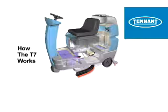When using the conventional scrubbing systems, water and detergent from the solution tank flow to the floor through a solution valve. The brushes, along with the detergent and water solution, emulsify the grime on the floor. As the machine propels forward, the squeegee wipes the dirty solution from the floor, and the suction created by the vacuum fan draws the dirty solution into the recovery tank.